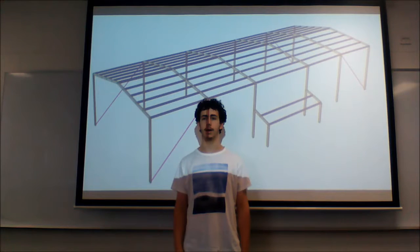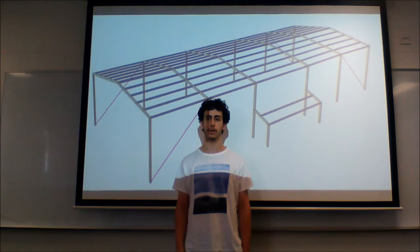My name is Sam, and I will be presenting the purlin and girt design considerations that had to be made for the facility. It was already predetermined that 0.48mm Custom Orb sheeting with Z15019 purlins would be required when considering the design. However, our team had to analyse the various load combinations in order to ensure that the structural integrity of the facility was appropriate.